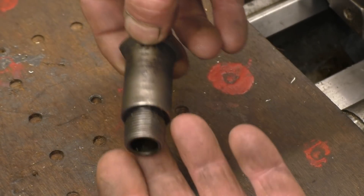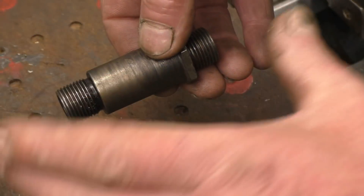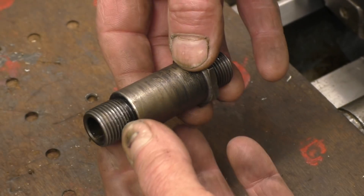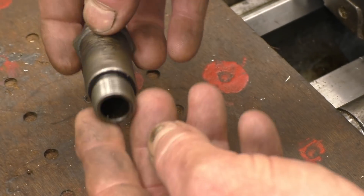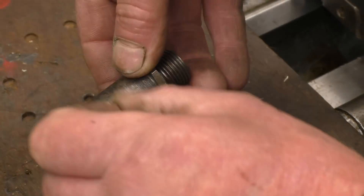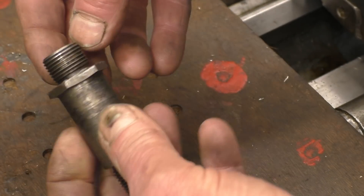This is a union of an oil filter adapter and what I need to do is make it 30mm shorter. Normally I would machine that down and put some threads on further down, but it's a proper awkward thread and it would mean changing all the gears on the back of the lathe, so I'm just going to cut it in half, take a bit out and weld it back together.